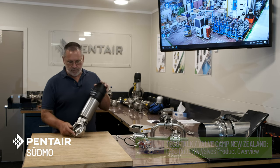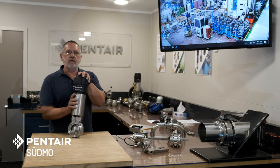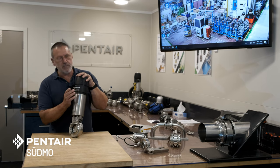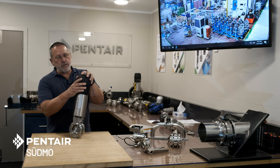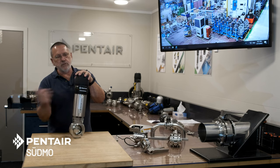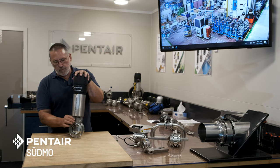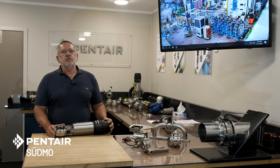The first one I'd like to show you is the F-250 butterfly valve. In this case we've got it mounted underneath an F-257 quarter-turn actuator. This is the four-inch version with an F-783E control head — E for Easy. This is a compact assembly with the control top and actuator internally ported, so there's no tubing on the outside, just air supply in.